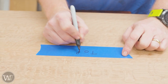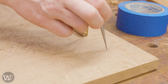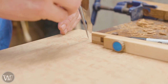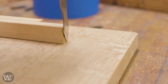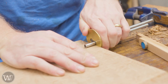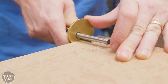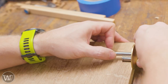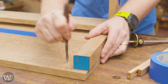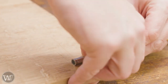Now I need to label this thing — of course it's the top. So now we need to get measurements exactly from this top because the top has to have two square holes that fit down in. I'm going to use a set of pinch rods to measure out the distance between the legs, because that's the most important thing. Then I can set off the measurement — that's the thickness of the legs — off of the ends of the pinch rods. And so then I have the two sides of the leg, and I can actually bring it over and lay the base on top and put the exact measurements on here. Setting up my marking gauge to then ride that mark, making sure that the marks are all straight. Use reality whenever it's possible — either with pinch rods, story stick, or actually setting the piece on top. Some of these marks I can just put the leg on here and know that this is my starting point, so I can make sure my hole is precisely the exact size as the reality of my leg.